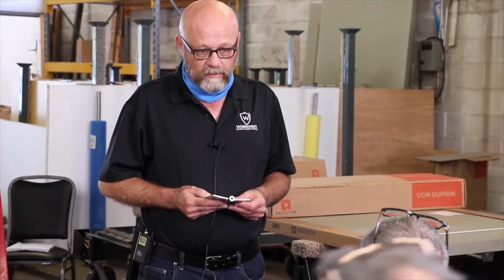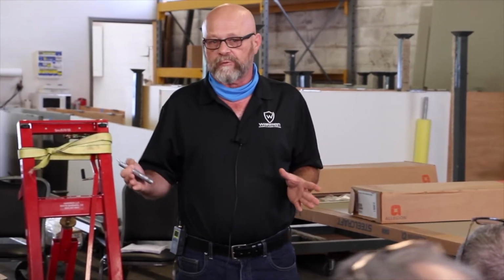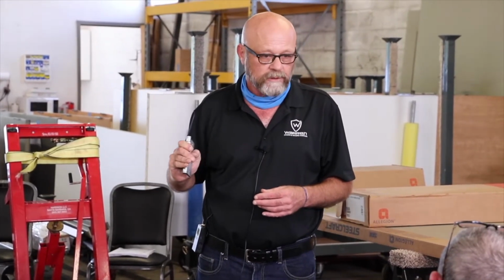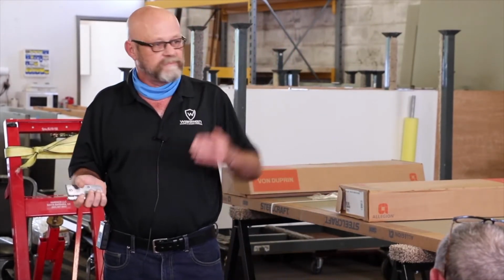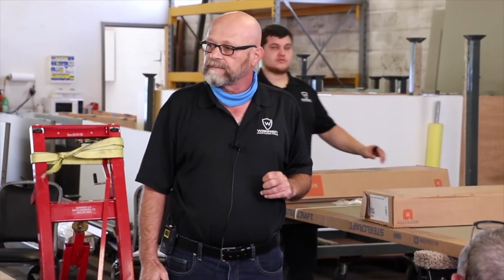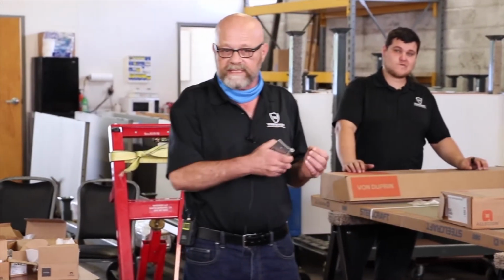So for like 300, 400 pounds, which ones should we be using? I will get to that. Okay. I'll get to that because myself, any door now that's over 3 foot or in a high abuse area, I put it on a continuous hinge because we're supporting that door all the way down rather than in 3 or 4 spots. Have you ever gone to a job and you've seen standard 7 foot tall door, maybe 3'8", 4'0" wide, but it's got 4 hinges on it? That's not standard for anybody. That was an architect trying to compensate for the weight of the door.